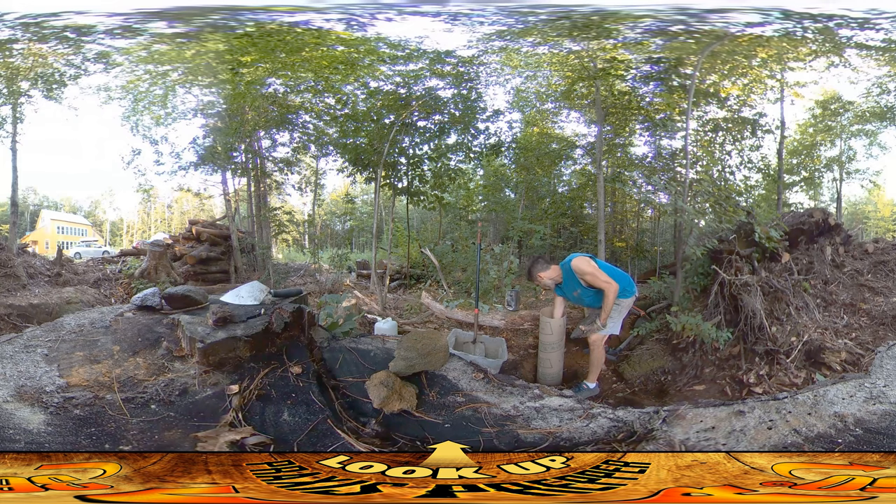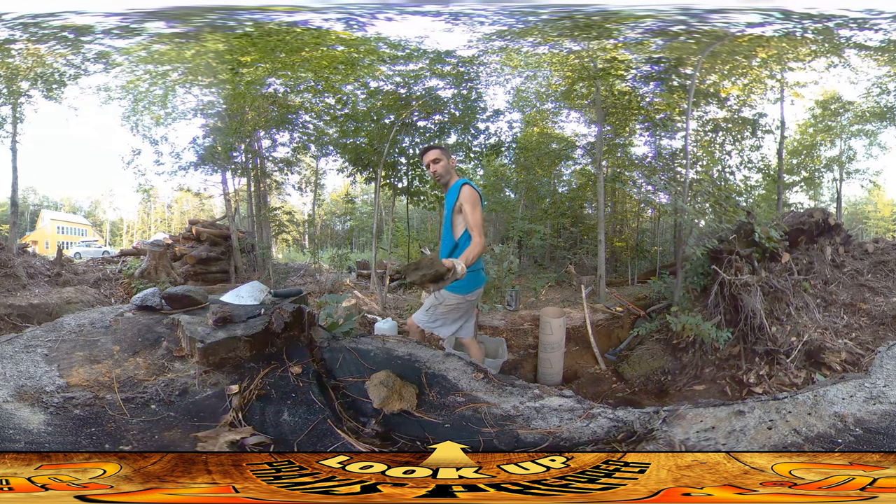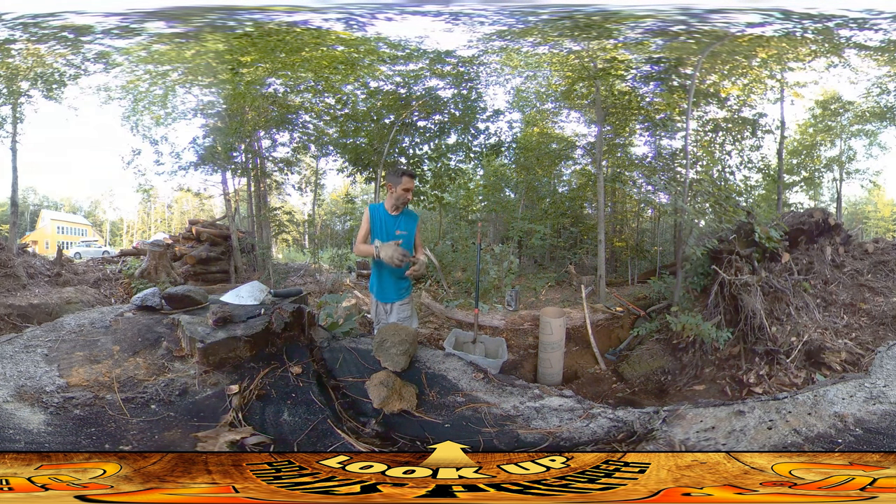I'm making sure that the rocks are not touching the edges — it's going to have a contiguous outside surface of this concrete mix. But these are good infill and they're strong; they're going to support the weight put down on top of them. I'm putting them right in the middle. River is also pre-soaking them while he washes them, because you don't want them to be dry when they go in.